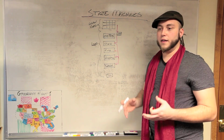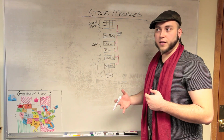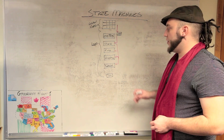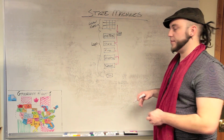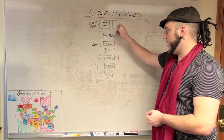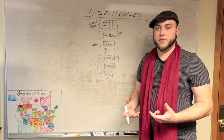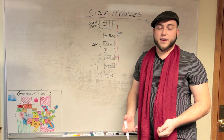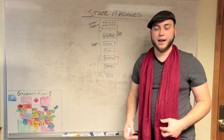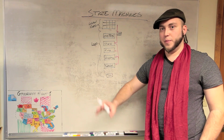All it does is it makes sure, have we sent out the serial message already? Is there a serial message to send out? Now, the reason I don't just bang it all out straight to the serial terminal is because serial communication takes a long time. The thing to keep in mind when you have a program set up with this architecture, if serial takes a long time, it's going to break your display module. Every time it dumps through here, it's going to get stuck in serial a little longer and then dump through. The display won't update fast enough to trick your eyes into thinking the LEDs are all on. Best case scenario, they all look a little bit dimmer. Worst case scenario, it just kind of breaks the module and doesn't act the way you expect. So that's why I have the serial handler making sure I'm not sending out one serial message every cycle.